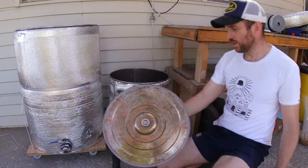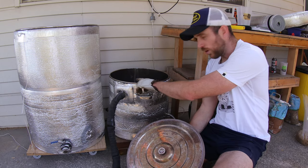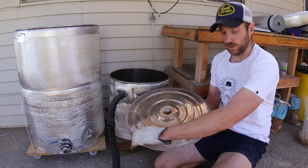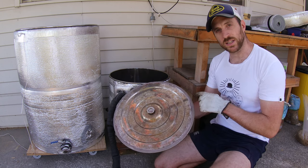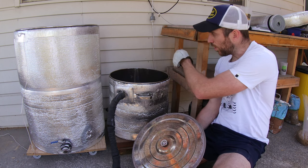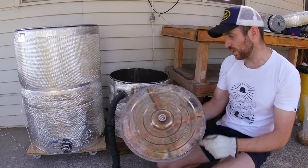To make the seal, all I did was line the top rim of the stock pot with Vaseline or petroleum jelly, then along the lid bead I put lots of silicone sealant, pushed the lid on top, put a bit of weight on it, and let it cure for 24 hours. Then I was able to peel the lid off and I had a nice silicone gasket — that's what creates the seal.